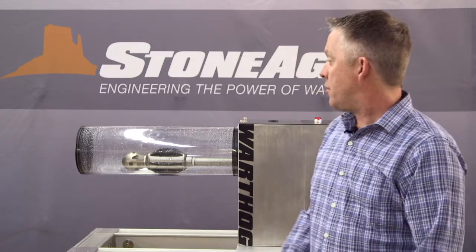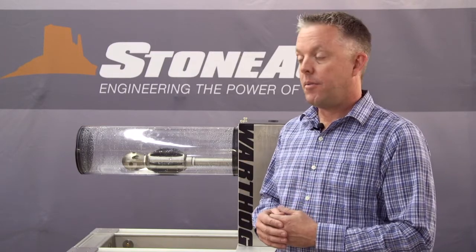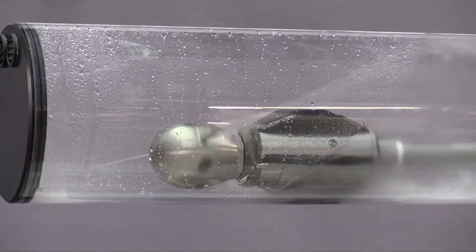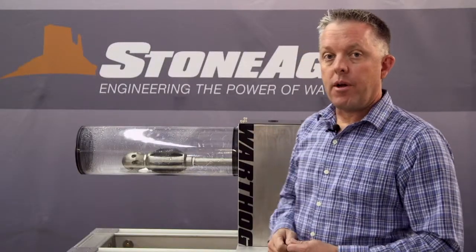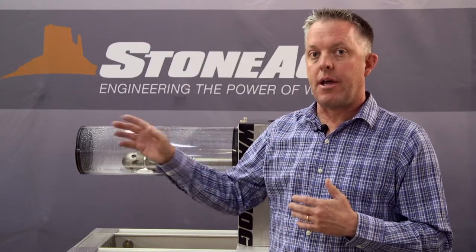The Switcher is a unique tool to the industry that allows you to change the direction of the jets on your tool when you're using it in operation. I'm going to demonstrate the first set of jets right now, which we call the pulling jets. That's exactly what you're looking for when you want to get your tool to go down several hundred feet of pipe and clean an obstruction that's either in a 90-degree bend or something that's clogging the pipe downstream.